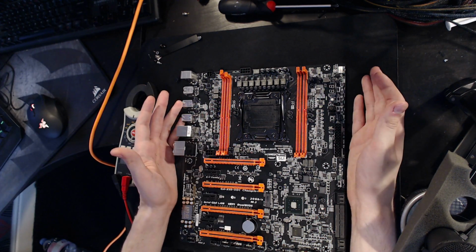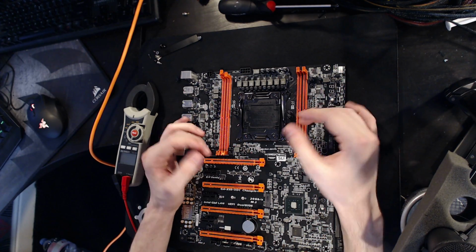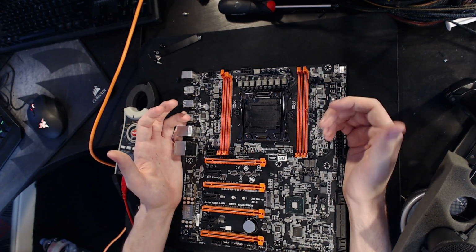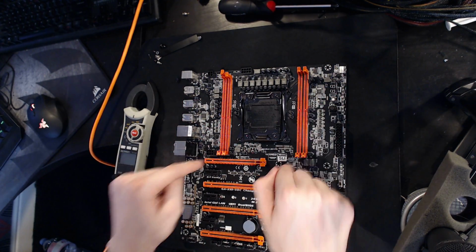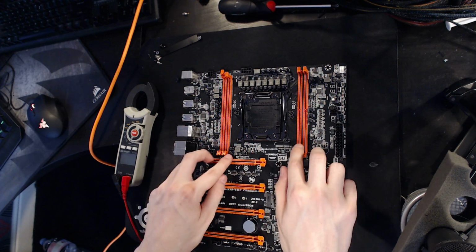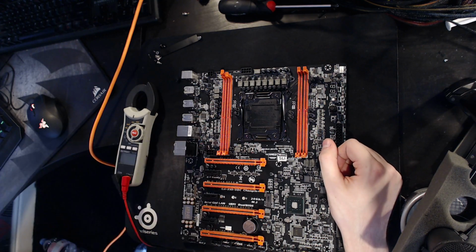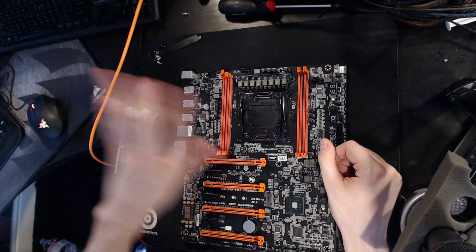And it did show. This board absolutely killed it for DDR4 overclocking on X99. There's not really any board that comes near it, except maybe the Rampage 5 Black Edition, or no, Edition 10. And that board costs a hell of a lot more than this board does. It also has 8 DIMM slots, whereas this does only have 4. But this thing kills it for memory overclocking because of just how, hardware-wise, Gigabyte has gone all out.